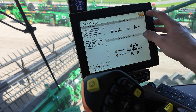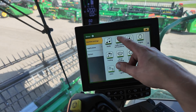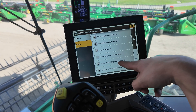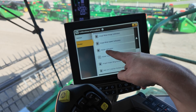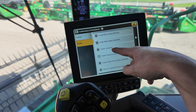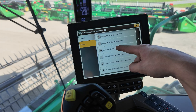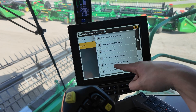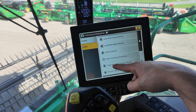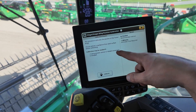All this relies on your hinge wing position sensors. Note that under Menu, Calibrations, and Header — if you scroll down, this is where the hinge draper wing position calibration is. You do not need to redo the header calibration if you've had a successful header calibration performed on the same machine, because you will pick up the gauge wheels regardless of on-ground or off-ground cutting. If you feel like one side is favoring hinging rather than the other, you may need to perform this on as flat of a surface as possible.